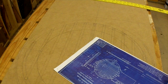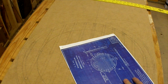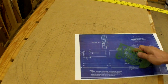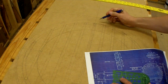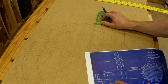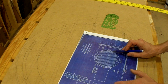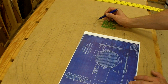I know it is not possible to both make it look exactly like this picture and also exactly honor all the dimensions shown. For example, we have instructions that the length of the openings are to be fixed by a circumscribed circle 21 inches in diameter — that's this circle right here. However, if we let that fix the length of the openings, we will be 1-1/4 inches from the outside. We have a 5/16ths chamfer going to right here, and also a 1-1/4 inch metal brace meant to stabilize the paddle. That will overlap entirely with the chamfer, and that would just look funny.